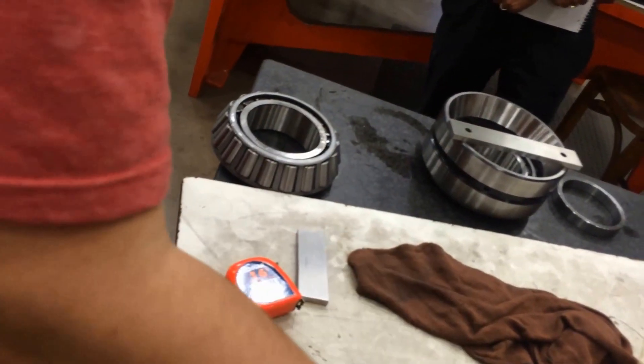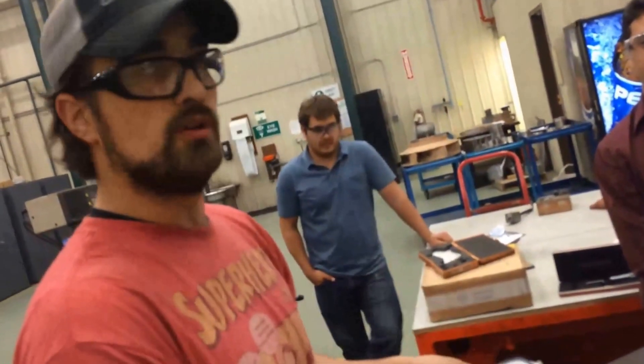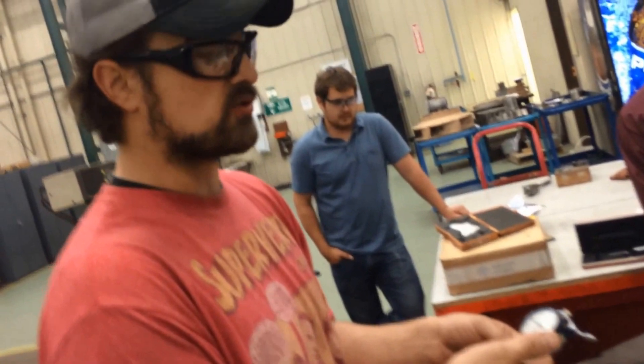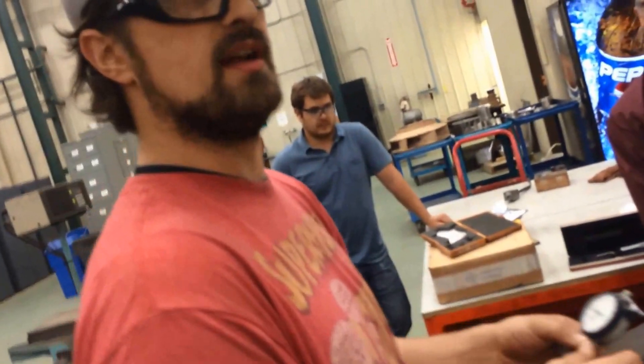So there you're just doing a verification of the gauge, right? Exactly — verify the gauge, check the limits at both ends and make sure it's consistent. It's a jewel dial from Mitutoyo and they guarantee the accuracy within one ten-thousandth of an inch. The graduation is only in a thousandth, but they guarantee the accuracy to one ten-thousandth, so it's good enough for the measurement.